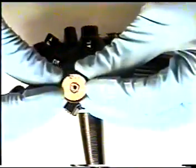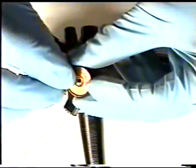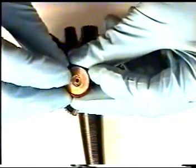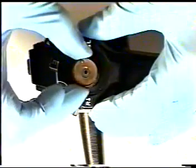Next step is to grab your left-right locking mechanism. It goes on with the open groove facing down. Be careful when refitting this piece, as the internal parts will tend to push up and break away if not seated down properly. This unit screws on counterclockwise.